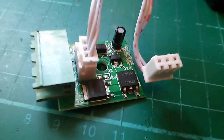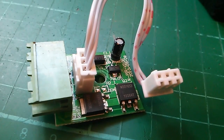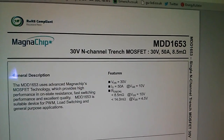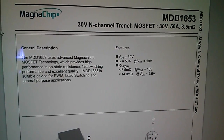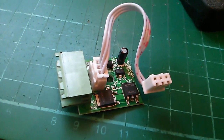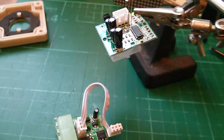While I'm waiting for my soldering iron to warm up, let's look at this driver board. I think the reason this has survived as long as it has is because it doesn't use a relay — it uses these two MOSFETs. I think they're in parallel; they're called MDD 1653. It's a 30 volt N-channel trench MOSFET, 50 amp, 8.5 milli-ohms. With two in parallel, assuming the gate drive has been done properly, we're talking about 4 milli-ohms — quite impressive. This thing was rated at 8 amps. I think if it did have a relay, it probably wouldn't have lasted as long as it has.